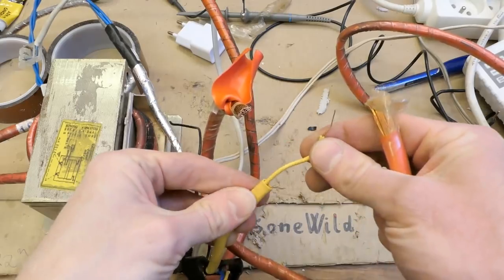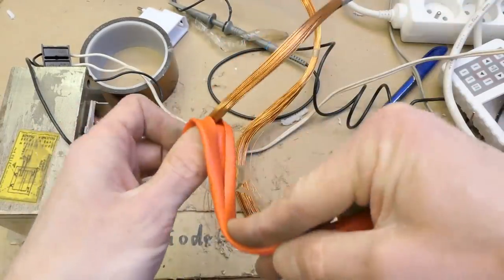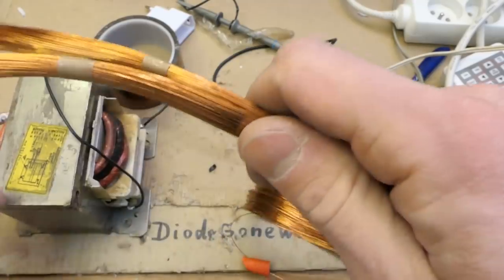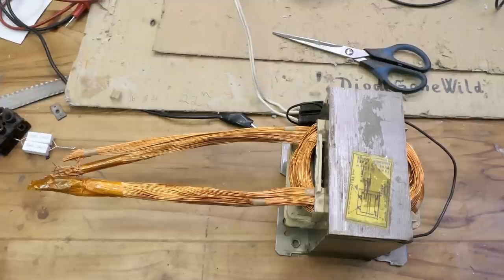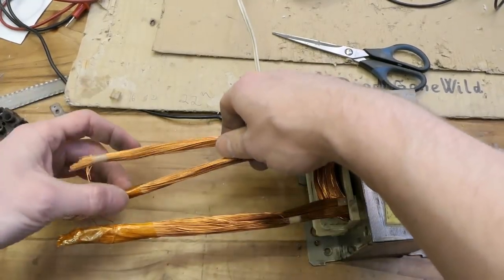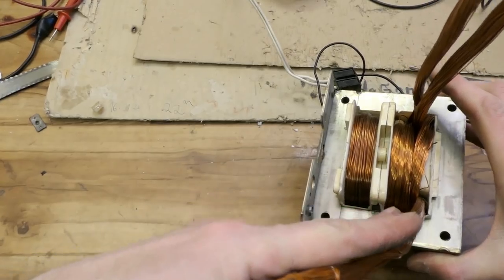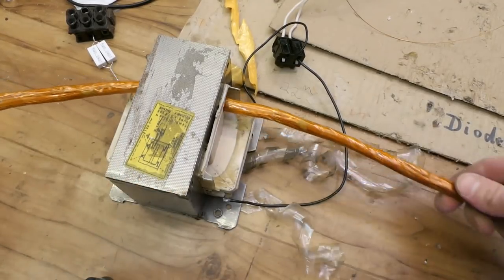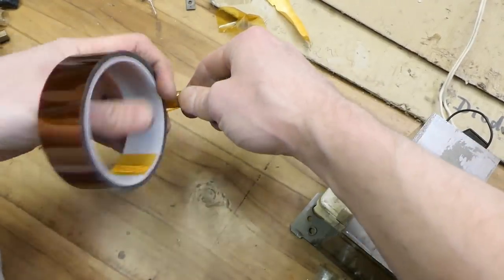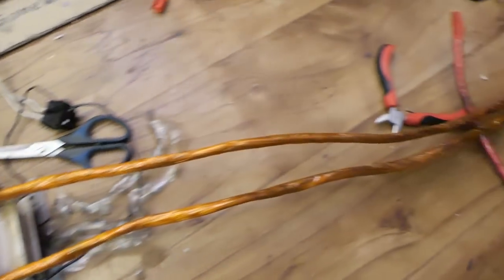Let's remove the thick isolation from it — it's wrapped like this and there's also this isolation on it. That's a decent cross section of copper. I'll use two in parallel, wrap them in Kapton tape, and wind it on. I tried to fit four turns of two degaussing coils together — it could work. I'm keeping it oval shaped, not circular, to fit better into the transformer. Sometimes it's easier to start winding from the center.